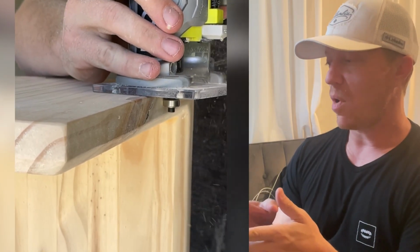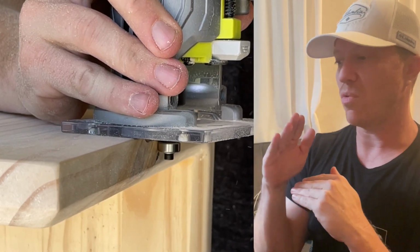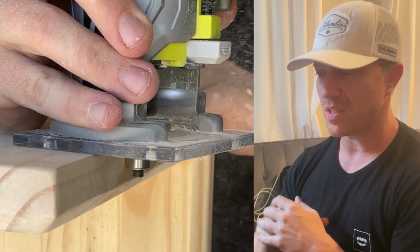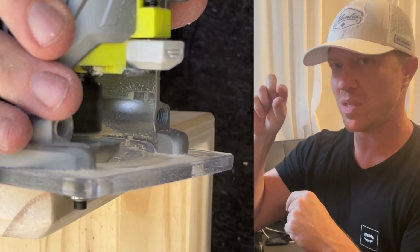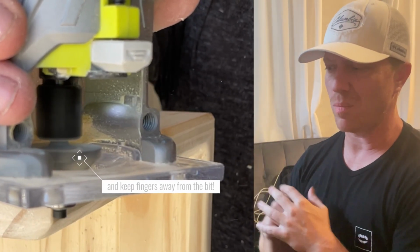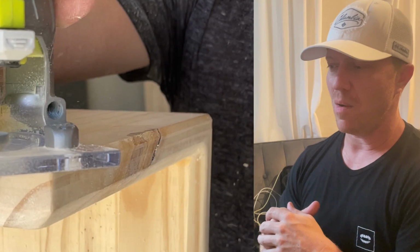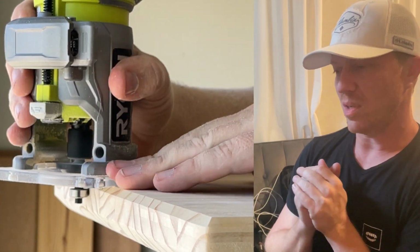So basically with the C table, I used the chamfer bit all the way so that I had the full 45 degrees of that chamfer bit, so that the inside part of the C table had the bigger angle to it. Then I lowered the bit to where I had maybe a quarter of an inch of the chamfer bit sticking up. So as I went around the top side, that gave me a smaller bevel than the inside. It was just a creative decision I made with this table. You get a little bit more space having that smaller bevel on the top, and then underneath you have that larger bevel, and it just looked good to me.